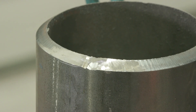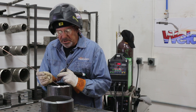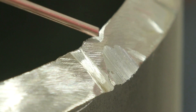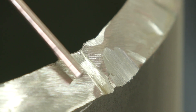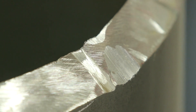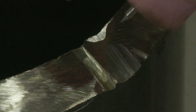I'm ready to weld. I've got this prep where I cut into the groove a little bit, and that start and stop I went ahead and gouged down clean again. There's a little speck right here — this one isn't bad at all. That other one is pretty heavy, but if this had a big groove in it from oxyacetylene or a bad start, it should be repaired and they don't take long at all.